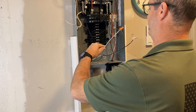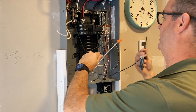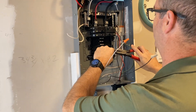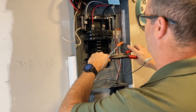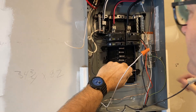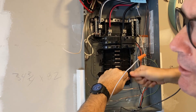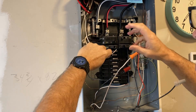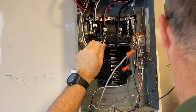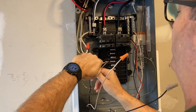I'm going to wire up the load wires first and work my way back toward the breaker. My preference is to always twist the wires, especially with solid wire. Reminder from the other videos: when you strip wires, be gentle. I've seen some of you guys work - some are brutes. Don't nick your wires, because when you twist them, nicked wires will break within weeks or months and you'll have a dead circuit.